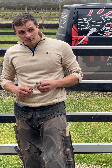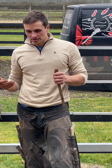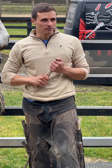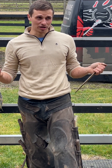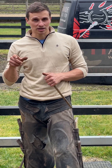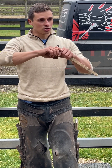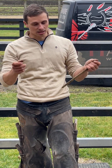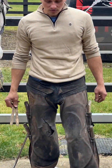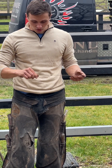So he's going to take up quite a bit of steel. Six and a half plus seven - that's thirteen and a half inches. I like to add inch and three quarter for my toe - anything from about twelve and a half inches upwards. When we get to about fourteen, fifteen, then I start adding two inches when we're going really big. But wider sections cover foot surfaces quicker - that's the other thing to take into consideration. If I was going to use inch and a quarter, I wouldn't need to add two inches because it covers surface much quicker. You don't need to go around a broader radius with a skinny section. So six and a half plus seven is thirteen and a half, plus my inch and three quarter - that's fifteen and a quarter.